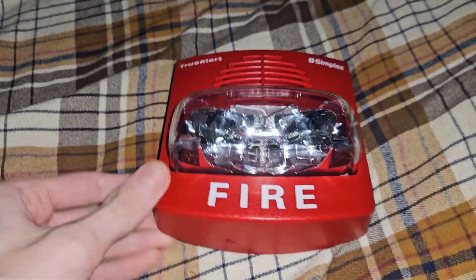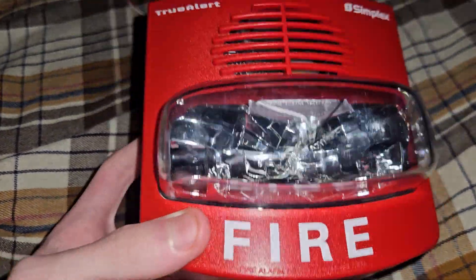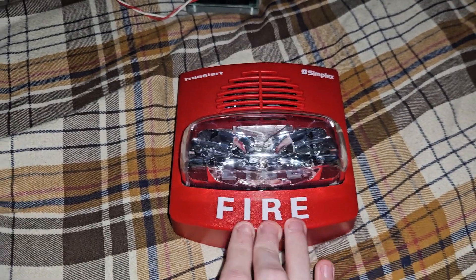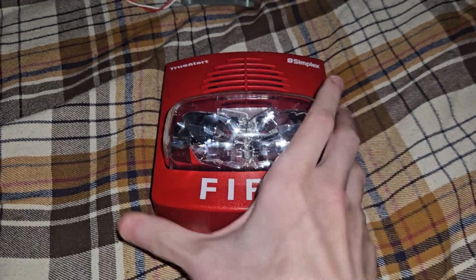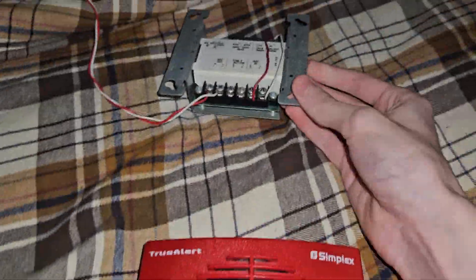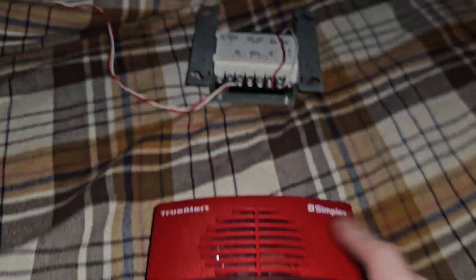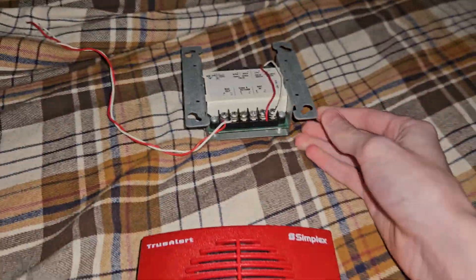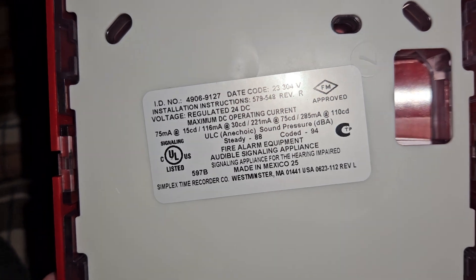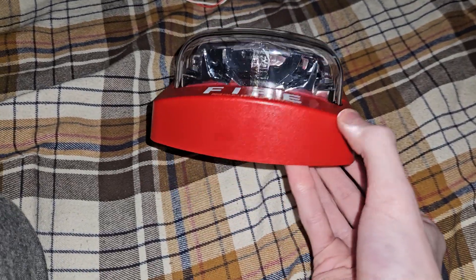There are a lot of people who get these and wonder why it's not working — because all two-wire TrueAlerts are SmartSync or addressable. Now, the 49CMTV series is two-wire and FreeRun, but this unit is not FreeRun unless you have the Sync Control Module. If you have this TrueAlert, get the 4905-9938 Sync Control Module. That was my overview on the 4906-9127 — this one is the newer version, which I will be stating in the description. Hope you enjoyed.